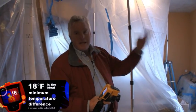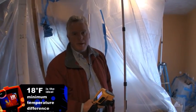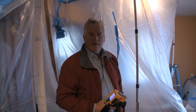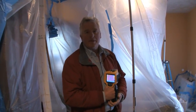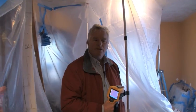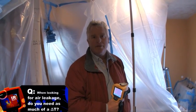Ideally, you want at least an 18 degree Fahrenheit temperature difference inside to out — that'll allow you to see the framing members. Once you've seen the framing members, you're going to compare whatever's in between those to the framing member. With newer systems and some skill, you can get used to doing it with less than that. You can typically get by with even as low as 5 degrees Fahrenheit delta T.